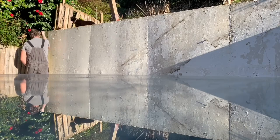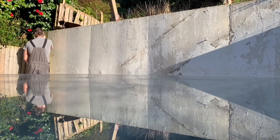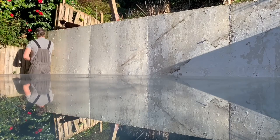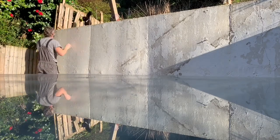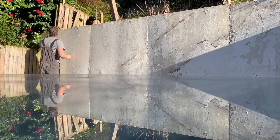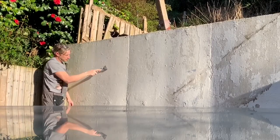Hello Darcy, how are you doing? What are you doing up there? Give the wall a fairly good scrape over. This wall was jet washed yesterday to take away the paint that was flaking away. The wall had previously been painted with an interior paint which brightened it up nicely but it didn't last. I've just taken off the obviously loose paint — there isn't much, the jet wash did the hard work.